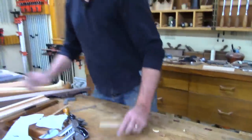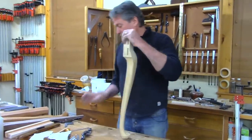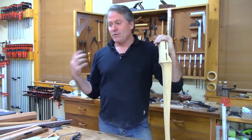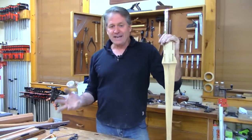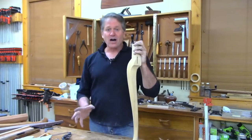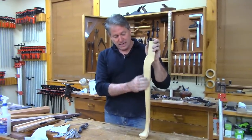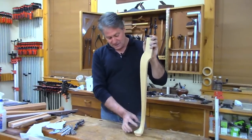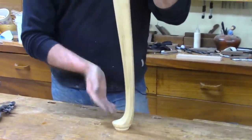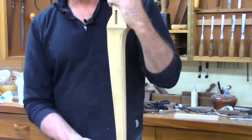Now, let's bring over one of the best ways. People aren't making spoked wheels as much these days, but for a furniture maker, where the spokeshave really comes in handy is rounding over surfaces. And for 18th century furniture, I used it a lot because you're always rounding cabriole legs. You start out with a square, and then you get that rounded and blended to appear round down here. So this style is sawn and then shaped, and it appears round mainly by the use of a spokeshave.